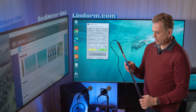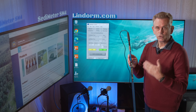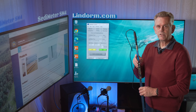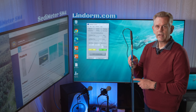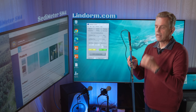That was the original reason. However, in order to make sure that it's not a fluke, we don't take just a single measurement — we take a series of measurements. As default, this takes 30 measurements at the rate of 10 hertz and in 8-bit resolution, and those data are presented in every measurement.